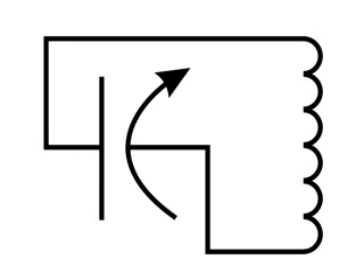This is the wiring diagram, and as you can see, it's very simple. All it is is a tank circuit. I'm using a regular tuning capacitor, and the coil, again, is 22 gauge, 75 feet. More wire needs to be added so it will get down to the lower end of the AM band, but it's extremely effective.